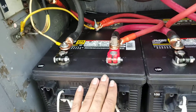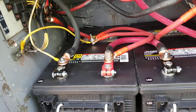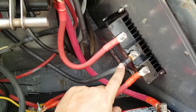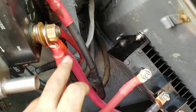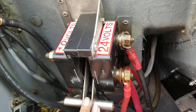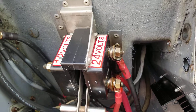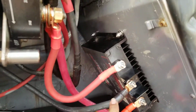It's a very smart device and it's constantly treating both batteries as if they were one, equalizing them. Another thing to keep in mind: this Vanner is always on. There is one exception to the 24 volt cutoff — this device always gets 24 volts. If we follow the 24 volt power, it goes where the 4-aught cable comes to the battery, so it is bypassing the cutoff switch. The cutoff switch has nothing to do with the Vanner, and that's how it was designed. Do not try to put it on the other side of the switch, because then the Vanner would only work when you turn on the switch, and that could be too late.